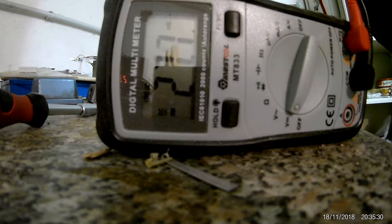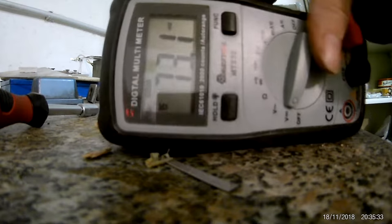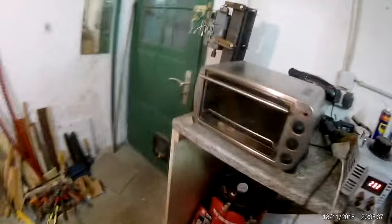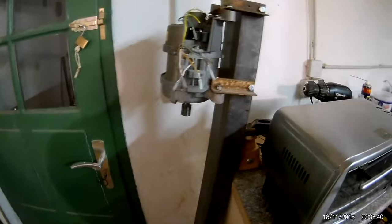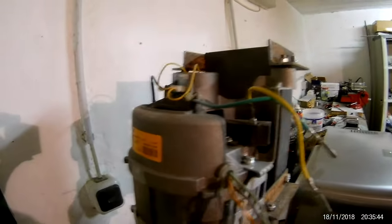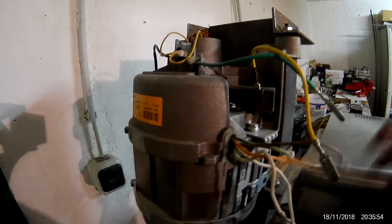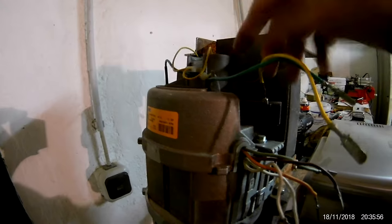The thing is, I bought this for my supposedly wood turning machine, which is still sitting over here with this motor on here. This one has field windings, which is, I think, brown and green. And well, it's like two windings, one on each side, with a middle wire, and the commutator here on the back with the armature. And this is just a temperature sensor.